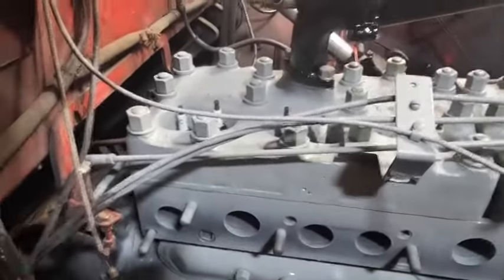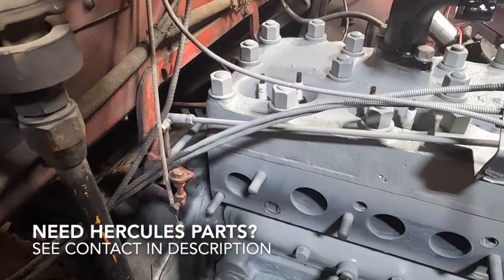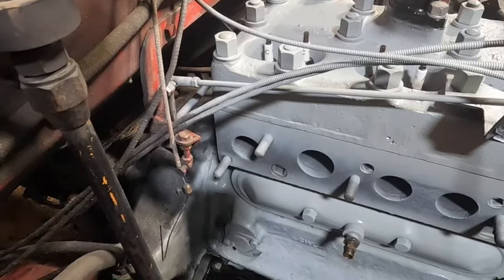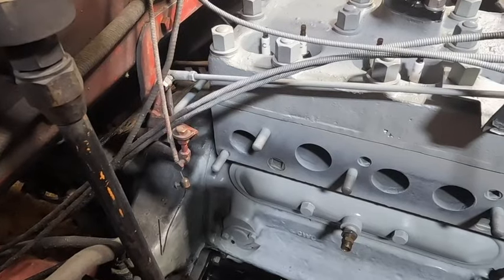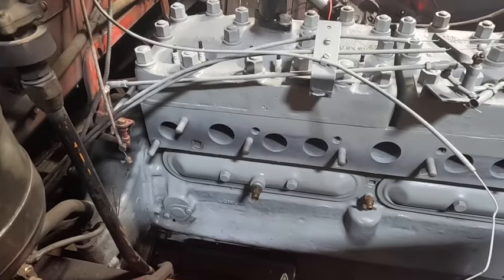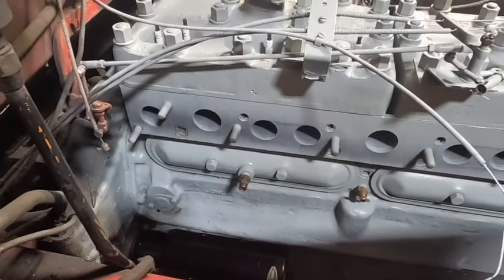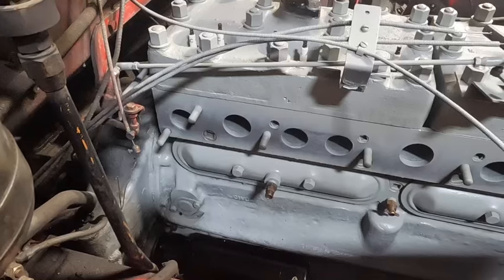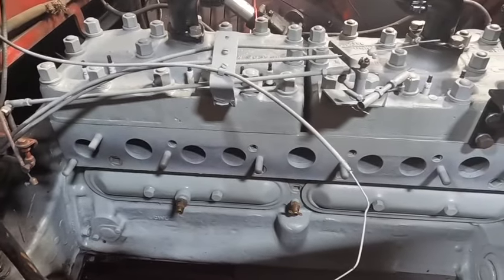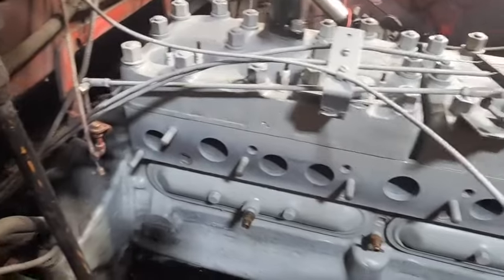We had to replace the number six cylinder exhaust valve. It was mechanically failed — the valve spring retainer broke in half and fell out into the valve adjustment box, and the valve key actually fell down into the oil pan. Thank God there was an oil screen on the oil pump because that little key could have gotten sucked up and caused a problem. We found all those pieces. We bought brand new parts from Hercano in Ohio, a supplier that carries Hercules parts — the valve, valve spring retainer, valve keys, everything. Everything's adjusted and done.